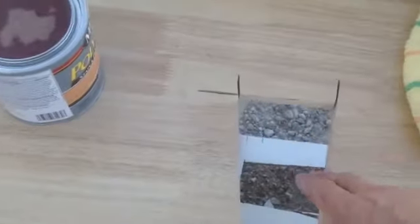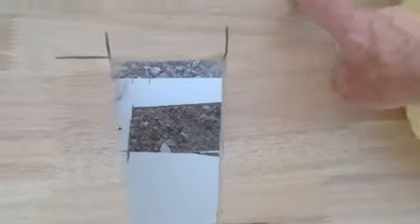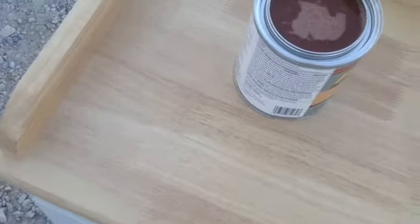How to install a vessel sink on a wood countertop for the bathroom sink. If you're going to use a cutting board style countertop like this one, it has some built-in water protection from the factory, but we need to add some extra water sealer — a polyurethane type of sealer stain — to make it more protective because it's going to be in the bathroom. The first thing you want to do before you install the sink is to put a stain sealer on the wood.